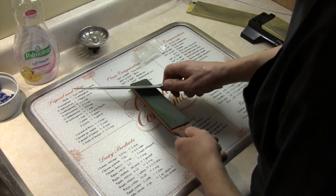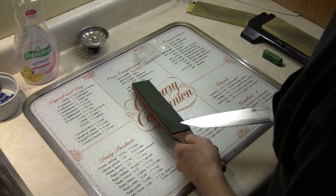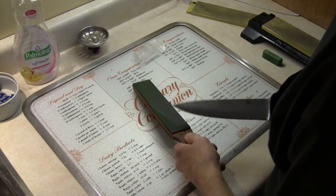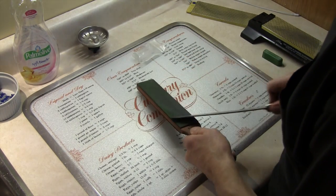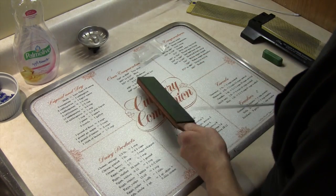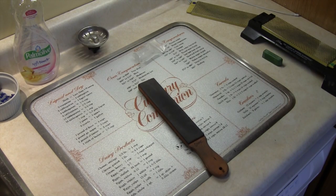You might be wondering why I used so many abrasives — why didn't I just set aside the diamond stone? I could have started with the 240 grit whetstone, then the 1000 grit, then the 8000 grit whetstone, and in normal circumstances that's what I would do. But I used the diamond stone so you could see what kind of scratch pattern the diamond stone makes under the microscope versus the whetstone, so you can see the difference.